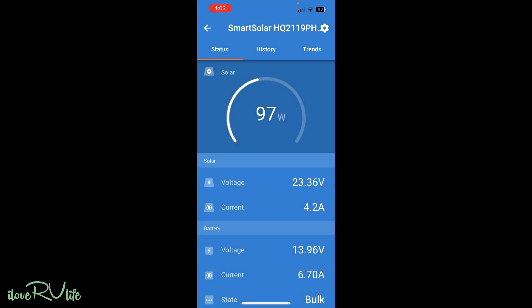Still impressive. I've taken out that whole bottom quadrant. What you're seeing with this bus bar configuration is: if that bottom fourth gets covered by anything, you still have three-fourths of the panel capable of producing power — still able to produce almost 100 watts. I had no idea that these N-type panels had this kind of capability. That is very, very substantial. Light clouds, a little bit of trees, air conditioner, an antenna on top of your roof — any of those things can impact your solar production depending on where the sun is, especially if you can't tilt the panels. So we're going to have to face this from time to time. Pretty impressive.